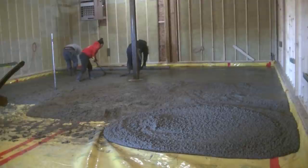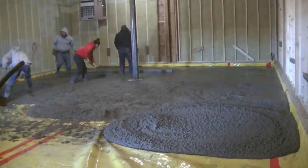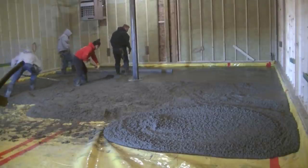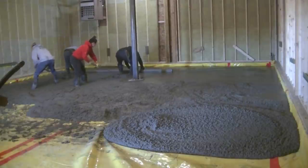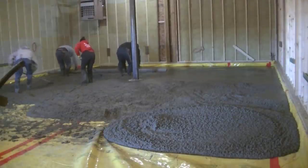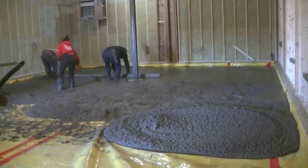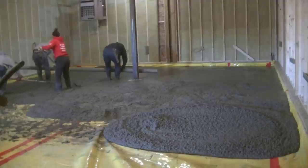What Darren and Luke are doing right now is kick screeding. You can see every time they pull that straight edge, I come in to help because we got it a little bit low — I should have dumped one more power buggy load there, but Tia and I will get some more concrete up there. If you like these videos, go ahead and smash the like button — it really helps with the YouTube algorithm. When Darren and Luke pull that screed board, they kick their feet in to fill their footprints, which allows them to keep moving backwards instead of stopping every time they pull the board.